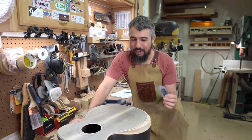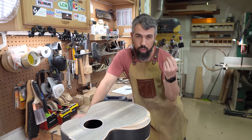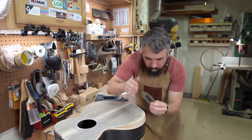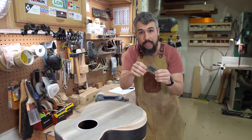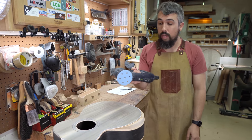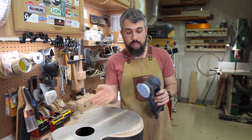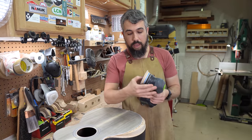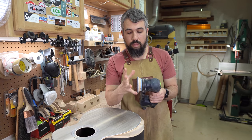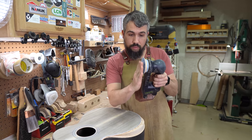Yeah. Gotcha. You are going to do it by hand that way, and we're going to use this technique even with my technique, is you're going to use some sort of straight edge once you start knocking it down and setting this on here so that we can visually see that we're getting a nice flat edge on it, just kind of a witness. What I use nowadays though is my trusty Festool Rotex sander with a 60 grit sandpaper on it, and the other trick is I replace the head on this sander with the firmest one that they make, so it has basically no play to it. So we know that this is perfectly flat.